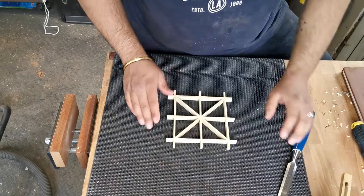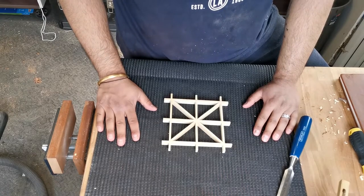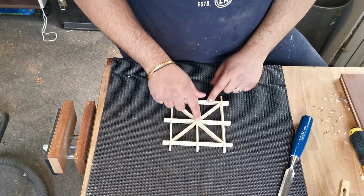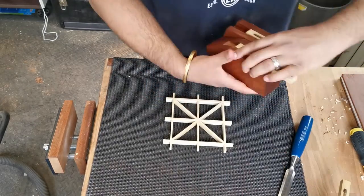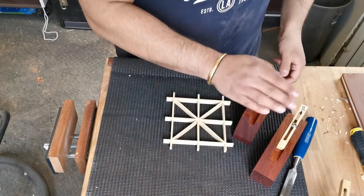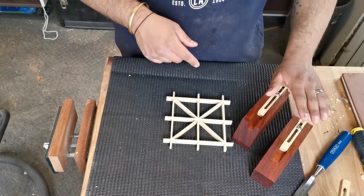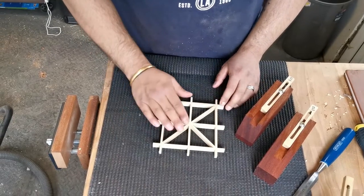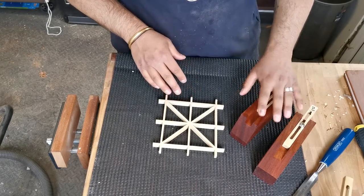The next thing is the next pattern. You could keep it like that as a simple star pattern, but if you want to make it more of a traditional look, then there needs to be a three-way joint in each of these triangles. To do that, I need to use the other two jigs I've created, which is a 22.5 degree angle and a 67.5 degree angle. I have posted another video on how I made these, so I'll add that link below. But for now, let's try and work out how we're going to do these. I'm just going to do a test run off camera, and then I'll explain exactly how I've done this using these jigs.